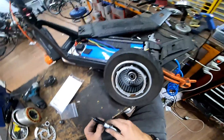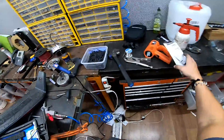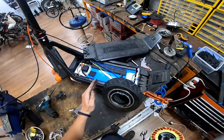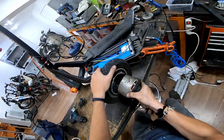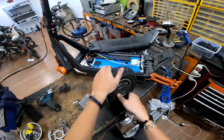That's gonna be enough. I've used about three and a half mils, which is plenty and more than enough. Next step is just to reassemble the motor back and enjoy — easiest hack to do to gain great performance out of your motor. Then we'll see how this motor will react to 40 amps.